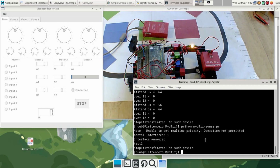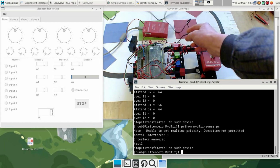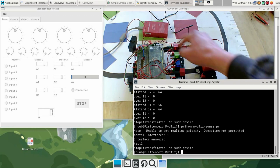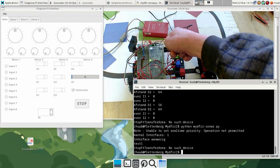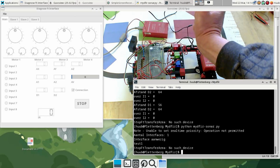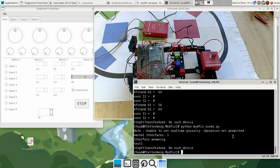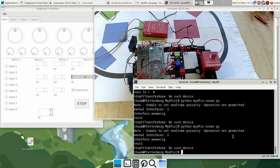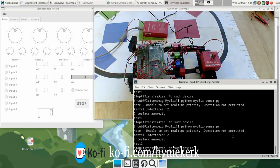Let's replace the battery pack with a power adapter. So this is the cord of the power adapter, and there you have a problem. Okay, this LED only shows for the battery pack, but wiggling the wires and then the interface resetting is clearly a problem of the connector inside the interface. But anyway, let's try to run. It doesn't do a thing. It tries to communicate somehow.